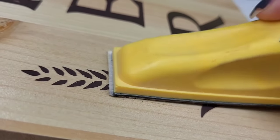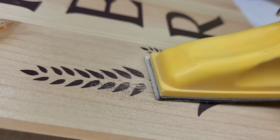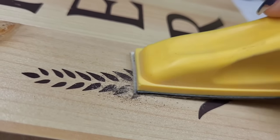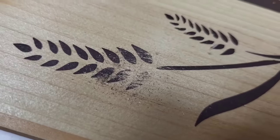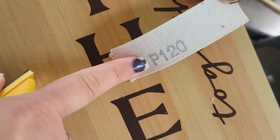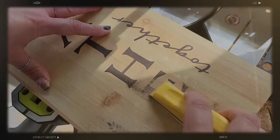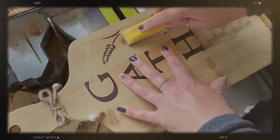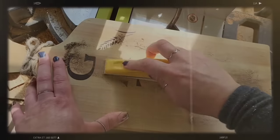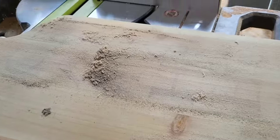That's right. This is going to just sand right on off of here. It's gonna take a little bit of elbow grease, and it started making a bit of a mess. So, you know, I retreated to the patio. And just in case you're wondering, I'm using 120 grit. The lower grit on the sandpaper, the more coarse it is. The higher grit, the smoother it is. The more coarse it is gives you the ability to really knock off any print like this.